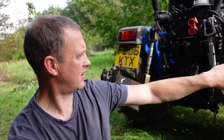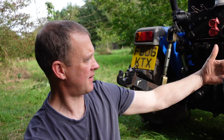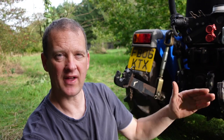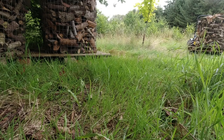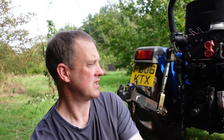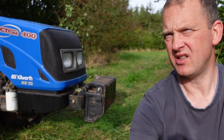The linkage lift on these is rated at 1,000 kg bearing straight down onto the linkage — that's what it'll lift. However, most implements have their weight way beyond that pivot point, so occasionally I can get the front wheels off the ground with a little bit too much weight on the back. I've got some front weights which help keep the front end where it's meant to be — touching the ground.